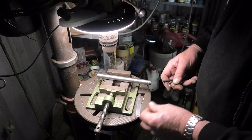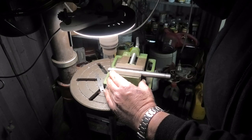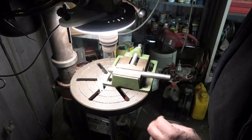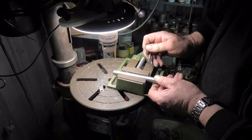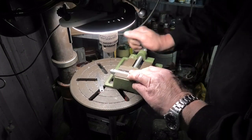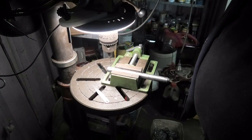I'm just going to drill the holes as straight as possible. That's for the R-clip. And now I'll put a 3mm pilot in, and I'll take that out to 6mm.